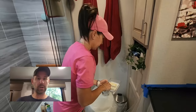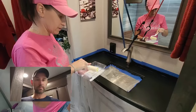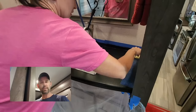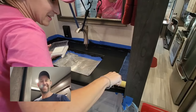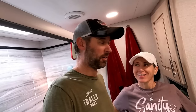Nervous? Yes, this one's making me nervous — it makes it permanent. It's triple thick so you only have to put one coat. It's a moment of truth. It has grip marks but it's self-leveling so it should turn out okay, it should flatten back down. It goes on with a whitish film but that's supposed to clear out. You'll see a little texture from the foam roller but it should flatten out, shine up, and all that whiteness should come out.